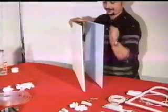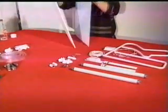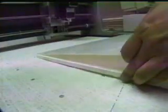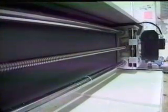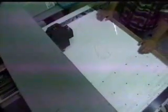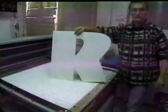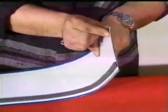Necessary materials: plexiglass, PVC, and an electric installation to illuminate the letters. We begin by cutting the letter front of plexiglass and the letter back of PVC, if possible simultaneously. The PVC letter back is typically 10 millimeters thick. Depending on the letter height, we use different plexiglass thicknesses, varying from 3 to 5 millimeters.